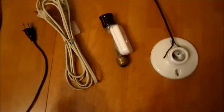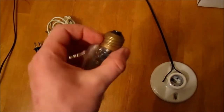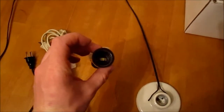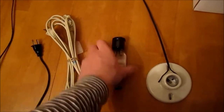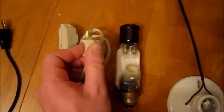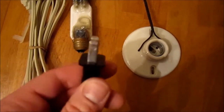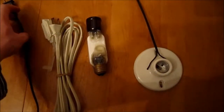It's very important to wire this thing properly if you make one of these yourself. You want to make sure that the outer screw is connected to neutral — the neutral wire of your 120 volt input — and the center conductor is going to be the hot. Make sure you continue that pattern up to the socket so the neutral is the outer screw and the one in the middle is the hot line voltage that you don't want to touch. Neutral is theoretically safe to touch, but that only applies if you have one of these things with a polarized plug — the neutral is the thicker prong. Notice that the one I'm using is not polarized; it's just got two thinner prongs, so basically I'm doing it wrong and you should use a polarized plug.